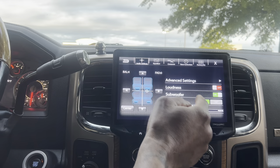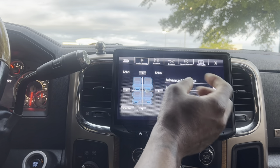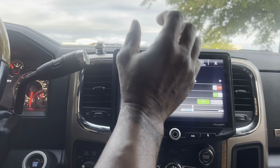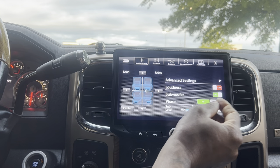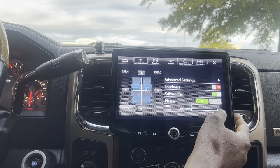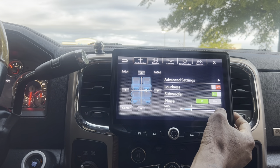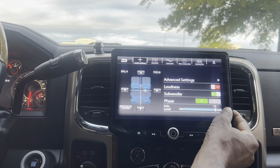As you can see, I use a lot of headroom. The reason why I do that is because music plays on dynamic peaks — as music plays at certain peaks in a song, you're going to get even more power out of your amplifier. I leave a lot of headroom. My M2000 is set to live at 2,000 watts at one ohm — that's when I have it at full voltage.